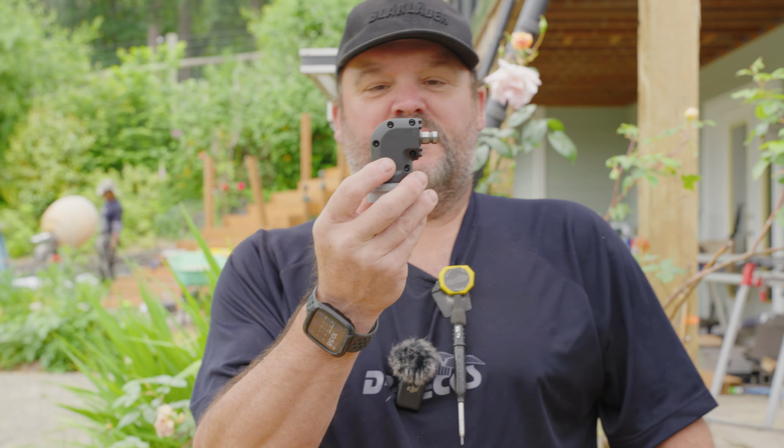And then probably the one I use all the time the most, an impact driver head bit, which just locks right on. And then this is what I was getting at. Like, see this right here? How this moves back and forth? When you pull up on this, it releases a ball bearing. So when you go to put a bit in, it drops in and locks. To get that out, you gotta pull up on this and pull the bit out. It releases that ball bearing that's inside of that chuck.